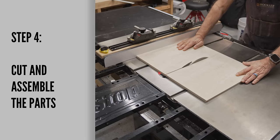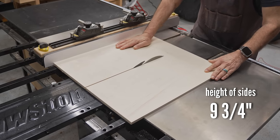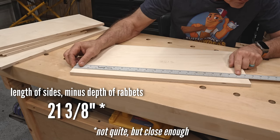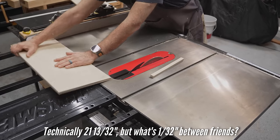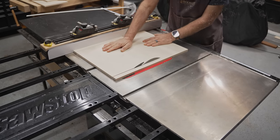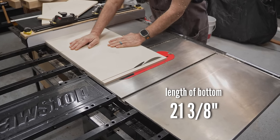I cut the front and back to the overall width and depth I had measured earlier, then laid out the sides. The height was 9 and 3/4 inches, same as the front and back. I determined the length by taking the outside dimension and subtracting the depth of the front and back rabbets — so that's 21 and 3/8 inches. The length of the drawer isn't really as critical; I was just shooting for close enough. For the bottom, I used dados to inset it, subtracting the thickness of the plywood from the overall width, and cut the length the same as the sides.